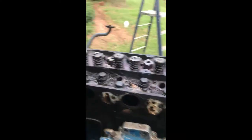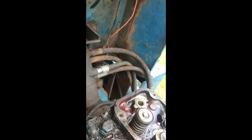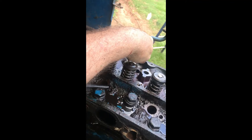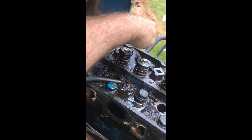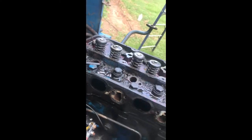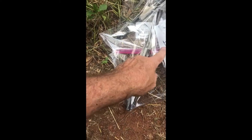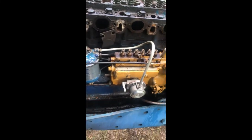Okay, so the last thing for today is I'm going to plug all these holes and run the power washer in here — I want to get all that grime clean. All these old cracked hoses, while I've got them exposed, I'm definitely going to change them. This push rod here was an intake and that one's an exhaust because it's close to the exhaust port. I've taken baggies and labeled each push rod — intake or exhaust — and each baggie has a number on it, so when it comes time to reinstall, the right push rods will go in the right spot.